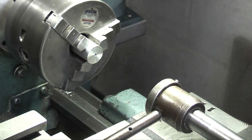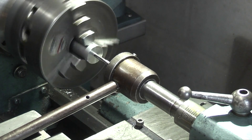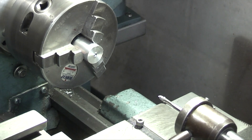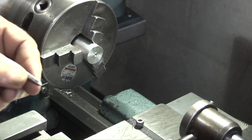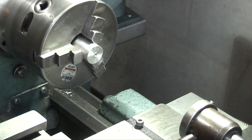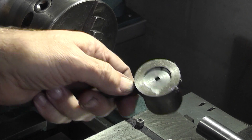Put the next tap in and it is ready to go again. So that was the idea - just to make it a little easier to tap holes. Now that is okay for the smaller taps, but you will find in a set of taps you have probably got five different sizes of square, and different suppliers of taps use different sizes so there is no standard. But it also gets rid of the tap wrench and your spring, and it still aligns it between the centres. It is just a steel blank with a square hole in it.